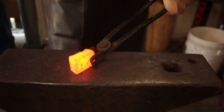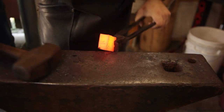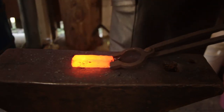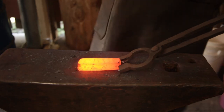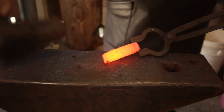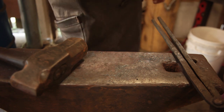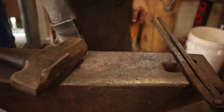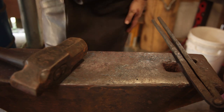Some of the Damascus steel for the bit. Holding up reasonably well. About that width, but I need to double its length so I can give it a fold and then re-weld. I just want to get the layer count up just a little bit more. This would get it up to a nominal 108. It'll be less because there's losses to grinding, but anyway.